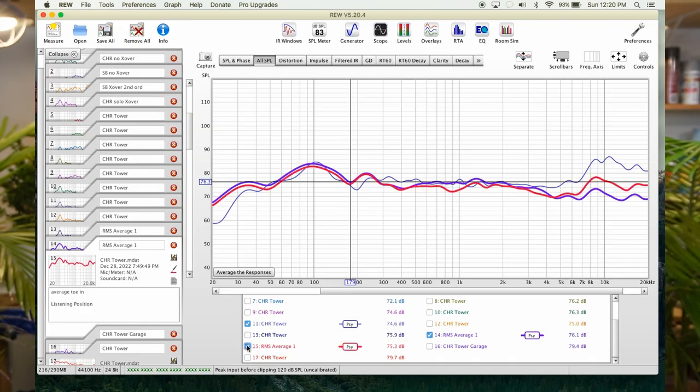But I have another curve here where the speakers are toed in. So I have the number 15. So we have those two curves, okay? The red one is a pretty good curve. The mids are more balanced, less intense. You have the highs still, you know? So the sound stage is still pretty good. I think if you open it a little bit more, it makes the sound stage wider, more focused in the center. So those are the curves, guys.